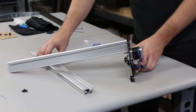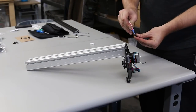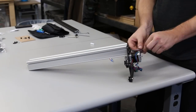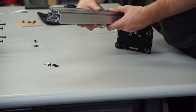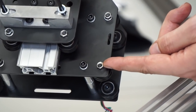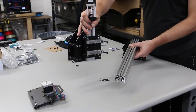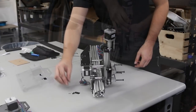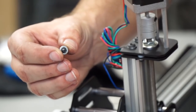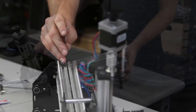You can see there are slots in the carriage plate. Make sure that the grooves for the maker slide are facing outwards — we're using the holes you tapped on the maker slide previously. Have the eccentric nuts giving you the most room with the screw down all the way. Gently slide this on — no reason to force it. If it's not sliding on easily, make sure your eccentric nuts are oriented correctly. This is a belt clip — put it on temporarily in the right spot using an insertion nut, making sure it's on the side with the motor and pulley.